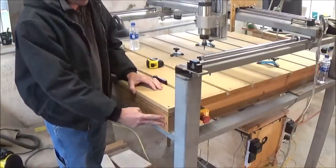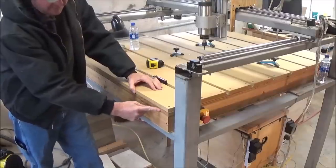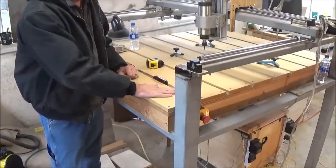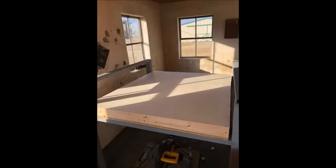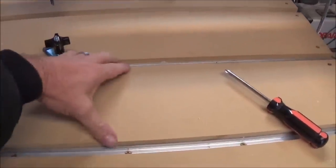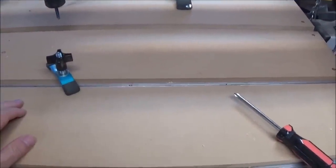I did that because I was having a 48-inch table — I did not want to struggle getting my table top in and out. My top is constructed of a two-by-four frame right here in the middle. Down at the bottom I've got it closed in with a piece of quarter-inch plywood, a piece of three-quarter-inch plywood, and then on top my waste board is MDF, medium-density fiberboard. I do it this way because if I mess up a section with my router, I can take a six-inch section and replace it, and it's fairly cheap.